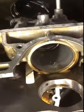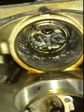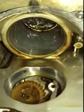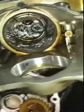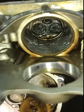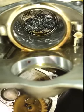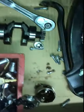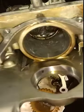Here we go. Turn on the light and you can see more clearly how things are. Cylinder looks fine. No scratches. The valves look dirty. See right there. Try to remove and clear that up. Okay. I have everything on this side. I'm gonna pull the piston rings and check them with the gauge and see how much gap we have.